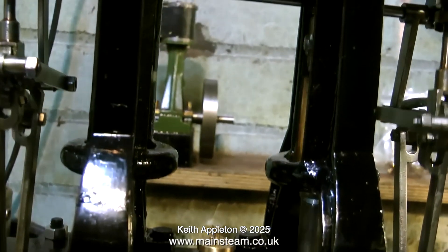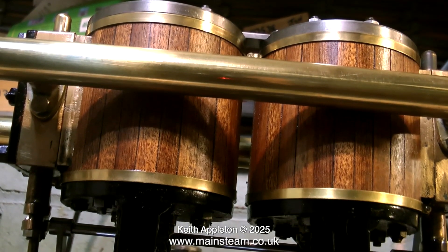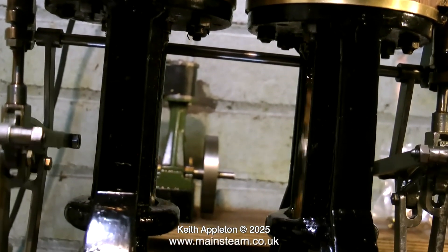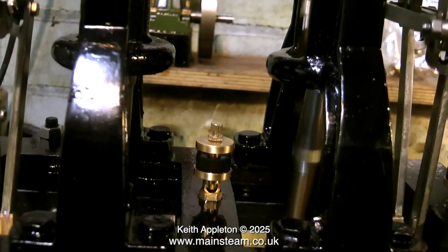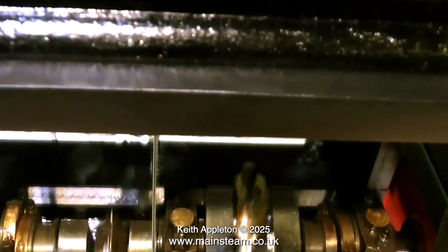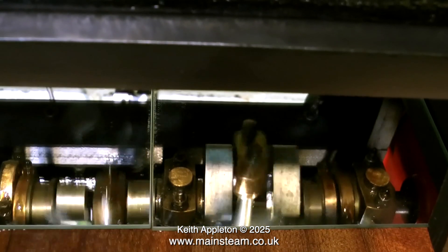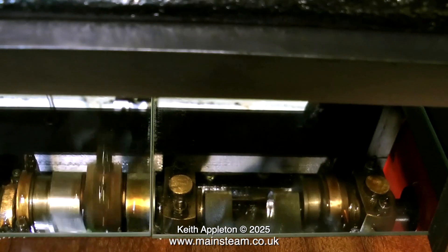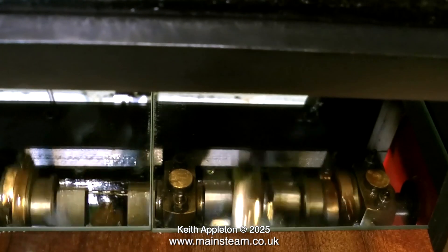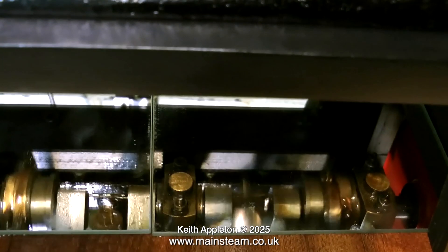As you can see this is a really large engine — two two-inch bore cylinders fitted with silicone piston rings. You can easily see the size of the engine when compared to a Stuart Number 10. A Stuart Number 10 is a very small engine, only about six inches high, but it really is dwarfed by this monster. Before I started the rebuild I was asked by the owner if I could fit a mirror underneath the crankshaft. I did, but when the mirror was in one piece it was difficult to remove and cleaning it to remove oil spots caused me to graze my knuckles on the crankshaft. So in the end I went for two easily removable mirrors — very easy to take out and clean.